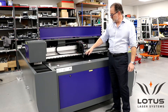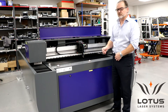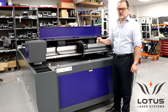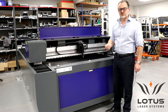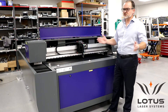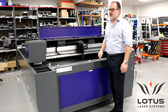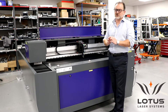This system is fitted with a 19mm optic, which is fine for this particular customer — there's no requirement to spend anything extra for his application. Some other applications where you're cutting thicker materials have an advantage in using larger optics, so the optic would go from 19mm diameter up to 25mm diameter. You would use that if you're cutting consistently thicker materials, or because you can get a wider range of focal length lenses at the larger diameter — for example, you could go to a 5 inch focal length. With the 19mm size the maximum is 4 inch, and in theory you can go to 7.5 inch if you have a 25mm or 1 inch diameter optic.